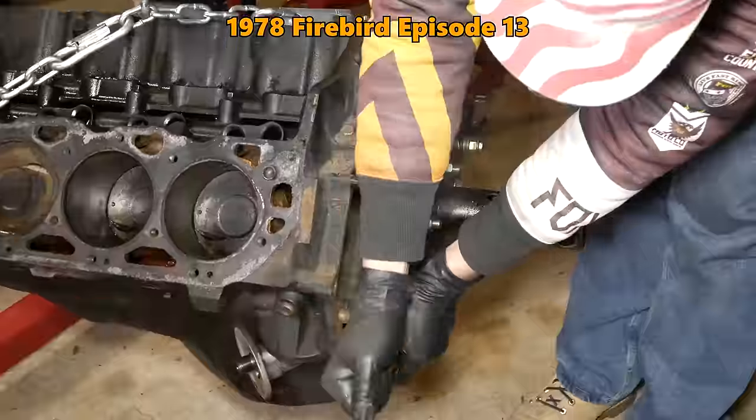The biggest change we made to the stand that I actually don't like is the double locking head pin. I severely underestimated the amount of water that would work its way into the upright of the stand while an engine block was being washed. We ended up drilling a drain hole, and drain it did. There was quite a bit of water sitting in there, so we will douse it thoroughly with WD-40 to try to prevent it from becoming a problem.